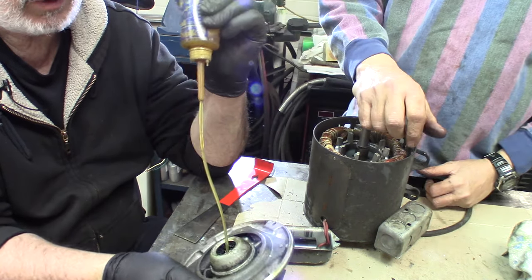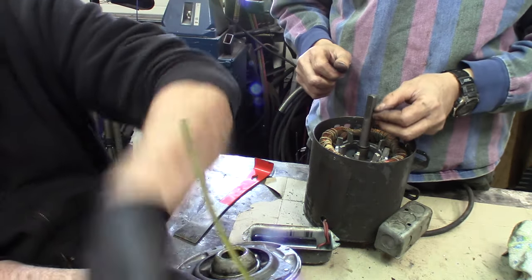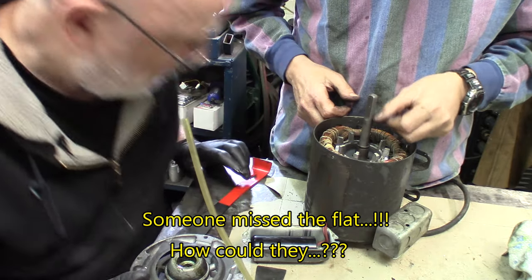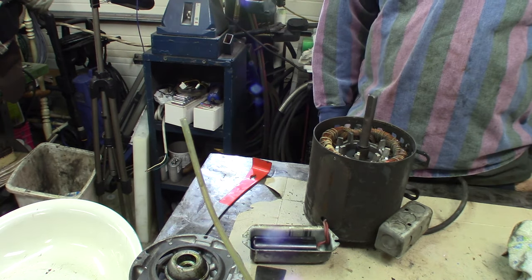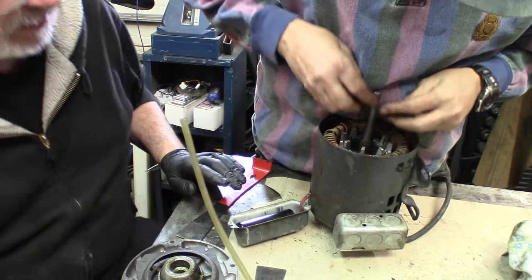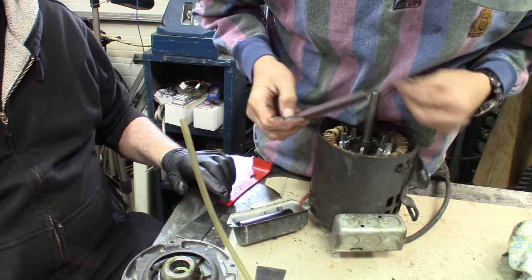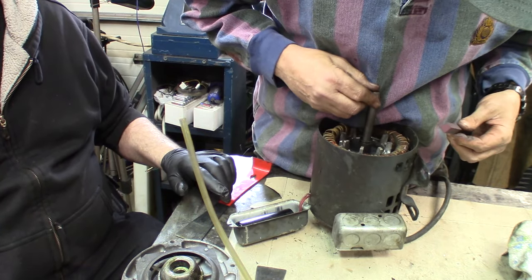We're going to have to repolish the shaft a little bit, maybe. The only place I might file, very light. Right here, look, there's a set screw that probably made a mark where it sticks out. Yeah, we'll get a little diamond there. Oh no, I've got better than that. Okay, try not to drop this one. It's the only one I've got left. Try not to go in the area where we've got the bearings. These are ruby stones. They last a lifetime until you drop them.